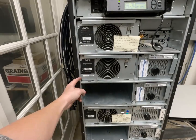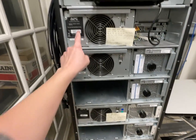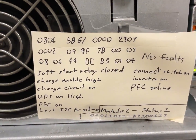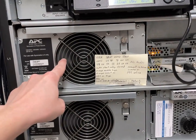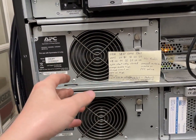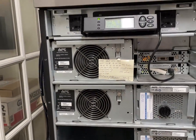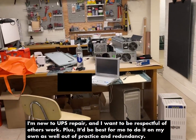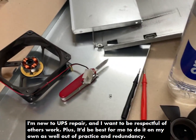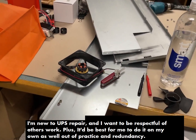We were down to two modules, and this one had a bad fan. I found these two were still good — no error codes, everything checked out fine except for the one with the bad fan. I think that was causing a lot of the errors, overheating and such. So I took that out and swapped the fan. I'm going to look at repairing these fans because the electronics work fine — it's just the bearings that get cooked, and it's not too hard to open them up.